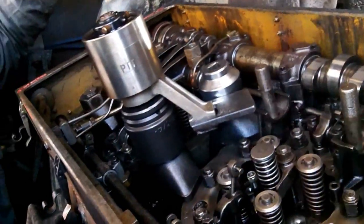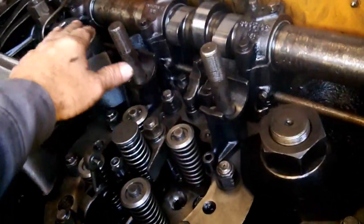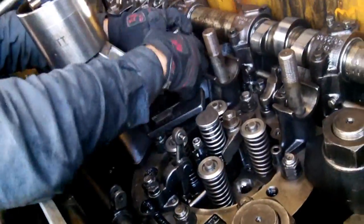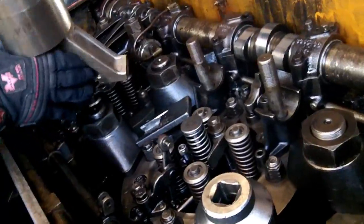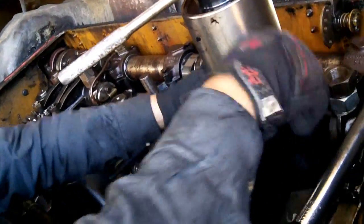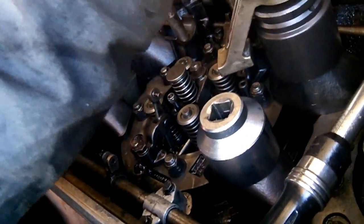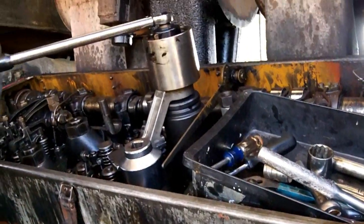That's the 800 foot-pounds on the first one. We're gonna jump to the next one, over to here, and then down to here, and then back up to there. And then we'll go back through and do it again at 1800 foot-pounds. With that multiplier is 26 to 1. So with a 20% loss, at 1800 foot-pounds, we only got to pull 87 pounds to get our accomplished torque. And right now at the 800 foot-pounds, he's only got to pull 39 pounds of torque.